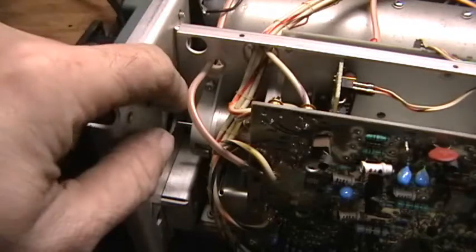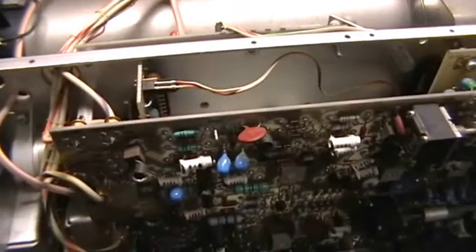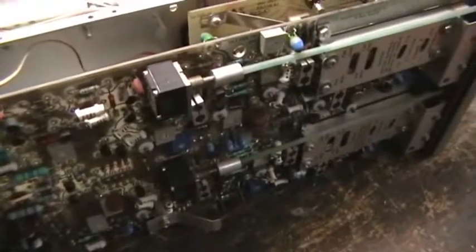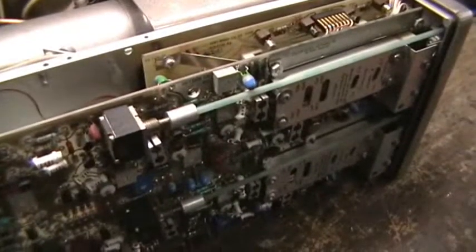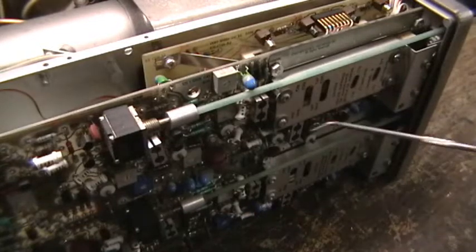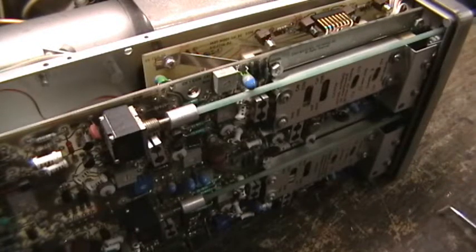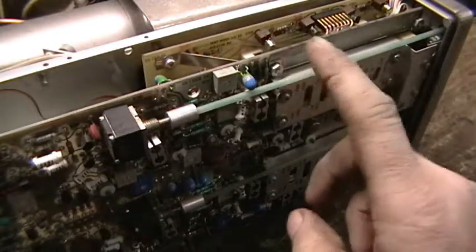As I said, the failure of that fan caused a lot of damage to other internal parts in the unit. And there's the vertical amplifier board, along with the range select trim capacitors and everything else. They like using fiberglass shafts back to controls located further down on the unit.